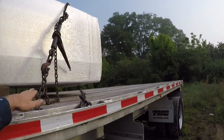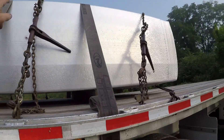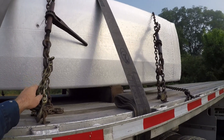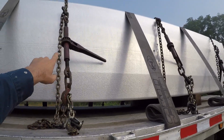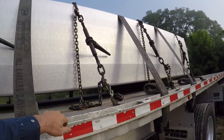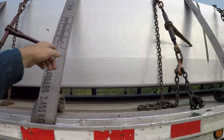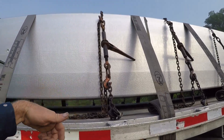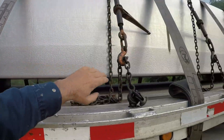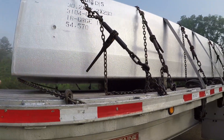Then I'll do my X-chains next. Once they're good and tight, I'll come back here, pull the binder — because I've already laid my three binders on top of the ingot — put this binder on and get it tight, move forward, hook this one, hook the binder, tighten it, hook this one, hook the binder, tighten it. That way I'm not walking back through all that mess.